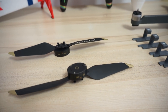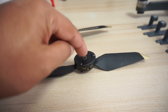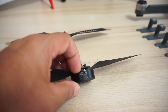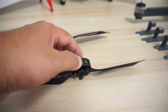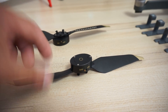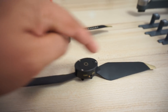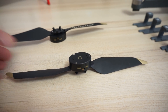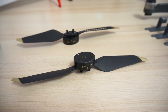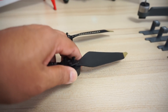The other doubt is how balanced the hub itself is. There is a battery inside, a USB port, an on/off switch, and a PCB board — the LED strip controller — all inside. So how balanced is this hub? The factory may have balanced the propellers, but did they balance the hub? If the hub is not balanced it will also cause a lot of vibration.